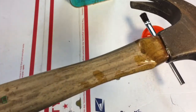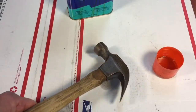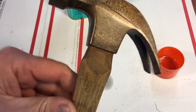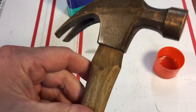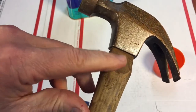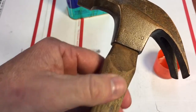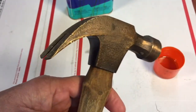From there we'll decide what kind of finish we're going to put on it. It's been a couple hours since we applied the linseed oil to the end grain of the hammer handle, and you can see it is absolutely dry and sucked well into the wood grain. We will keep applying the linseed oil until we get a sheen — a shine — that lets us know it's pretty well close to the surface. But right now it's bone dry, meaning we still have to keep applying.